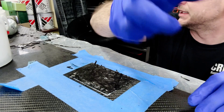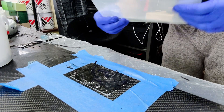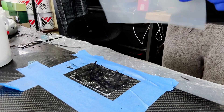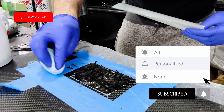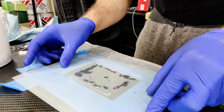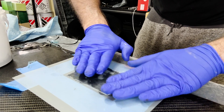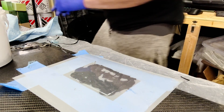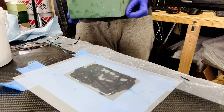This is nicely saturated now. We use a sheet of mylar — basically whatever plastic they use that does not naturally stick to epoxy — and it will give us a really nice finish. Most likely we will be able to sand it afterwards. We put something weighty on top to apply compression.